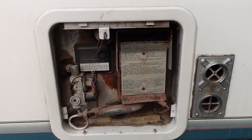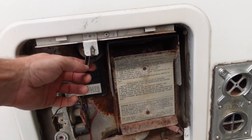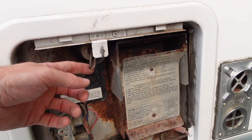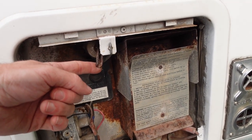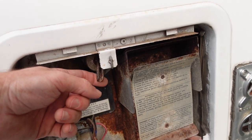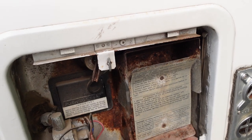Make sure your water heater is actually full. All you have to do is come up here and pull on this lever — if there's air inside it will release the air first, and once there is water all the way up inside that water heater it will release water. You can see it just comes right out.